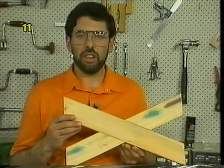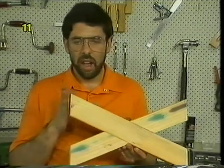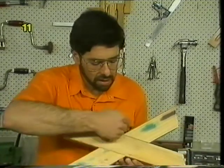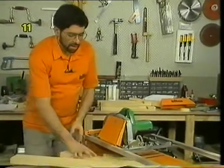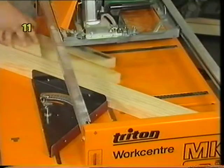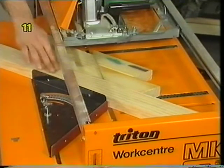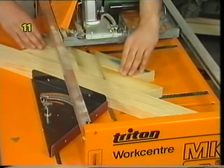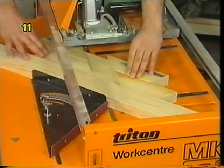Just before leaving mitre cutting, here are a couple of joints. Firstly, the halved crossover joint — very strong and very useful if you're building gates, fences or verandas. Cut your pieces to length and mark them in position where they cross, then put the two pieces into the work centre with the pencil marks lined up exactly. If you're working with very long heavy pieces, use the protractor to set a straight piece of wood at the required angle — normally 45 degrees — then clamp it. With your blade raised for a half-cut only, make a series of cuts, moving the wood sideways after each.